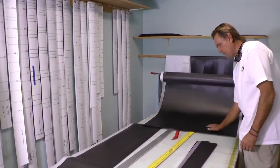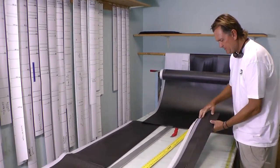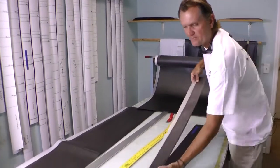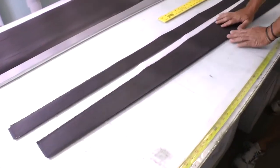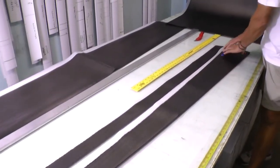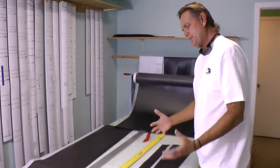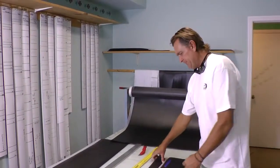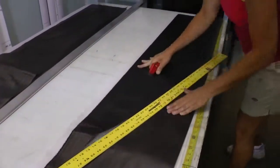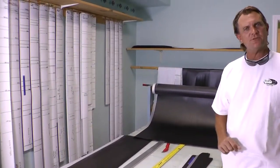We start with this large sheet here, and then our patterns. You can see the different cuts and slips. The pennant shape, this would be your tip section. This is the butt section down here. And this material gets cut, and the rod can be one piece up to 8 pieces of material built in for one blank. After you see it being cut here, we're going to go outside, lay it up, put it on the mandrel, and roll it through the warehouse and through the shop.